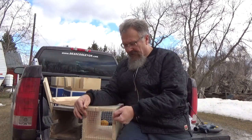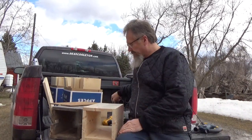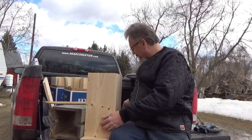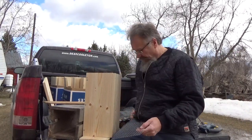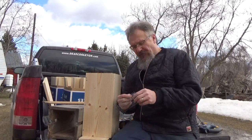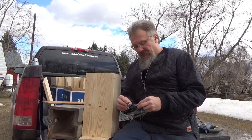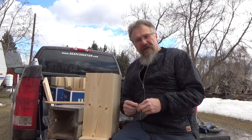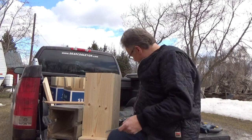I also have pre-cut wire mesh — part of a roll I cut to specification. It's half-inch mesh, which I like using. When I attach the mesh, I don't staple it — I've stapled it in the past and just don't find it lasts very good. I use small fencing staples and put about eight in, trying to catch the mesh as much as possible. I just find the staples withstand weather better.